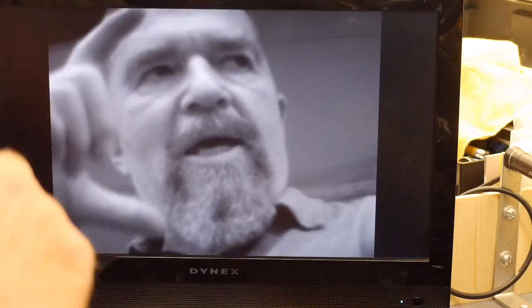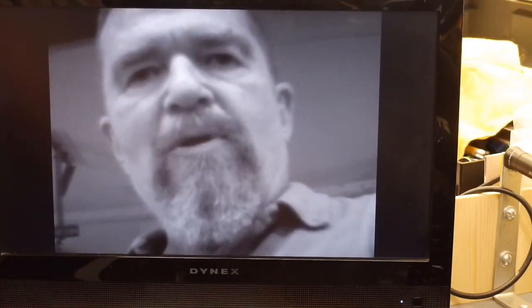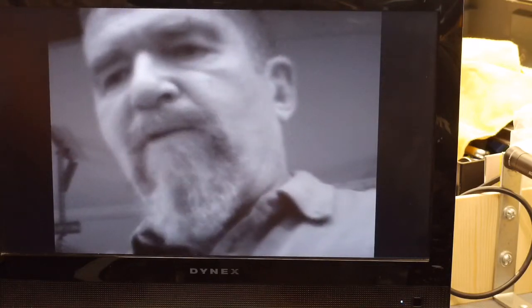There's the red light, and there's the picture. This is a 4x3 video signal — composite analog video — and I've set up my TV monitor to display a 4x3 normal aspect ratio. So the angle of view: I'm holding the camera at almost arm's length and my face pretty well fills the screen, so it's a fairly narrow angle of view. Because it's a fixed-focus, fixed-focal-length lens, they had to choose an angle of view. In 35mm film terms, it's probably at least a 50mm equivalent, maybe a little longer than that.